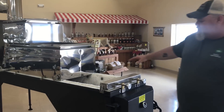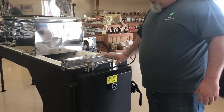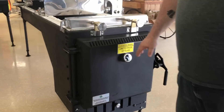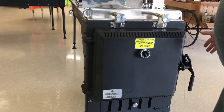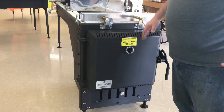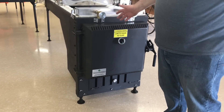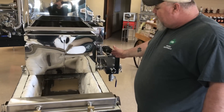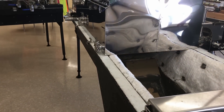We have a two by six here and I just took the front pan off and set it up there so we can show you the inside. We have an air-cooled door on the front with a sight gauge so you can see your fire, which is standard on our bigger machines but we've started putting it on the smaller ones now. The door is reversible — we can move the hinges and the latch to either side on site, depending on your sugar house and which way you want the door to swing. Same with the pans — the pans are reversible. The float boxes can be on either side; all the fittings are here and capped so they're completely reversible on both sides.